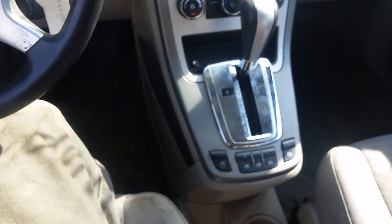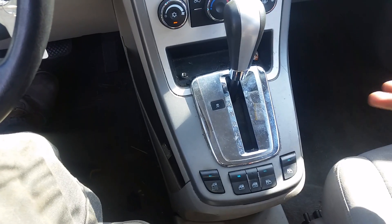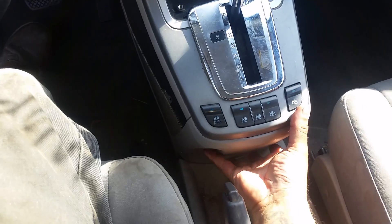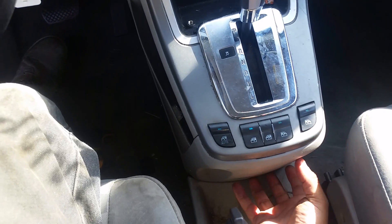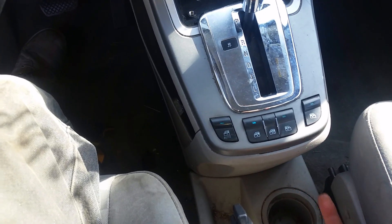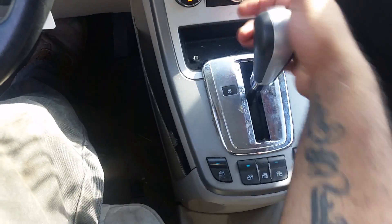So that's where it's at — it's on the side, right underneath. You can access it from this angle, or like I said, if you pop the cover off and pick this up, use a flashlight — put the flashlight in here and just go this way. You'll be able to see it better. Just a long screwdriver, put it straight through and you'll be able to get it into neutral.